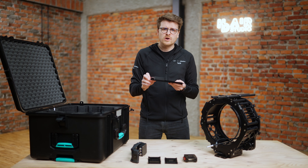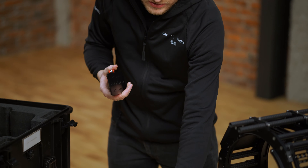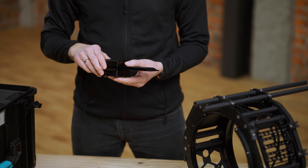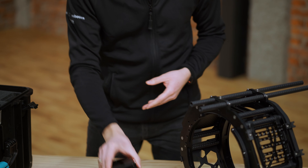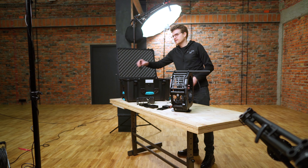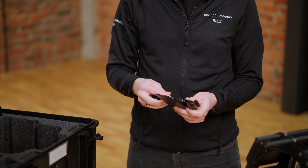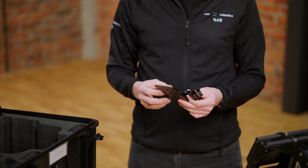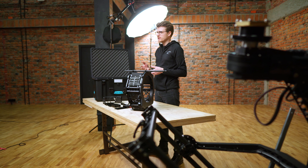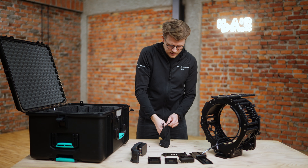Now let's move to the slip ring — this is a slip ring rotary connector that features three ports: an SDI 3G video pass-through port, a camera power port, and a CAN port used for the gyroscope sensor. The slip ring is a great option because it gives you an unlimited number of rotations both left and right without the risk of twisting or breaking cables. However, if you don't want to use a slip ring for some use cases, you don't have to — just connect the gyroscope sensor cables together using a dedicated LEMO joint connector that is part of this set.